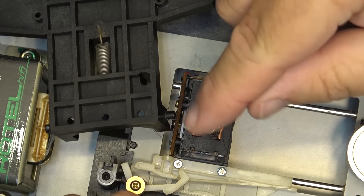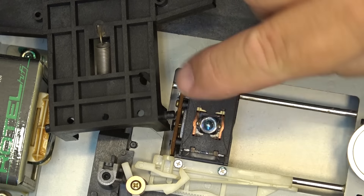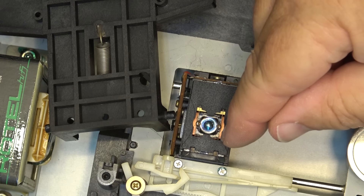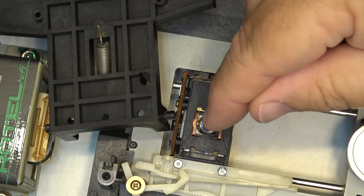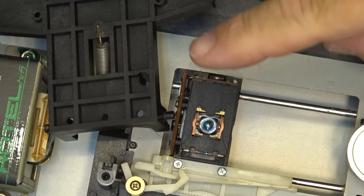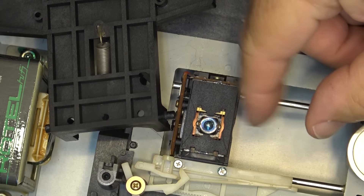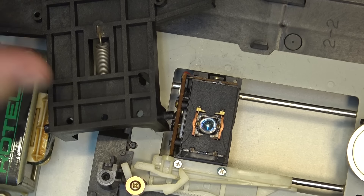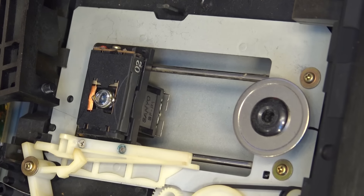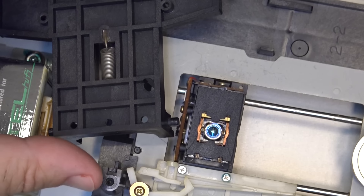There's a dissecting mirror at a 45 degree angle - the laser beam shines up through that mirror and up to the disc, and on the way back down when it hits the mirror, it's reflected 90 degrees over to the side spot detectors that read the pickup. This is a Sanyo pickup - it says Sanyo on the side. The SFP1 is the pickup that Rotel used.